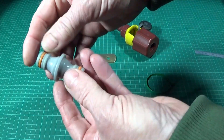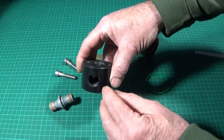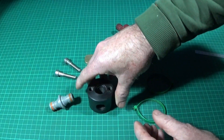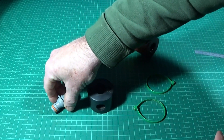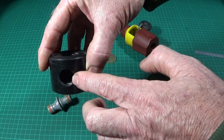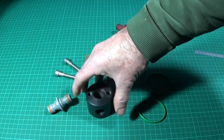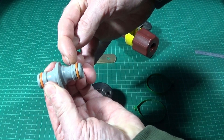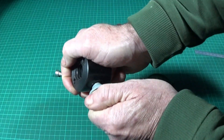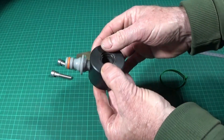I thought the simplest and quickest way to make this up would be to use an original water connector rather than make one from scratch. This connector has the same fitting on both ends, so I drilled and bored the outlet hole to give a good finish and fitted the o-ring with a nice squeeze. I also machined a counterbore at the front with another o-ring groove — a slightly larger o-ring — and that one goes over this shoulder when the connector is pushed into the adapter.